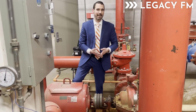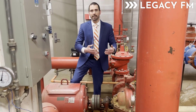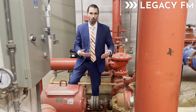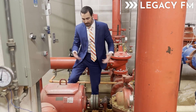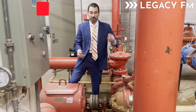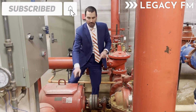If you want to read more about this, the NFPA 25 handbook has a lot of great information on angular and parallel displacement. It's in section 8.3.4.4 — we'll post that down below. Make sure that your fire pump is being checked for displacement.